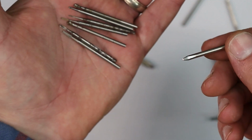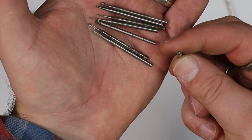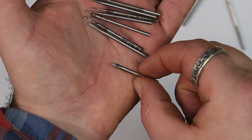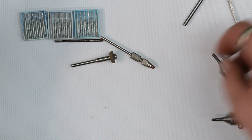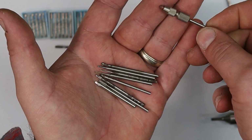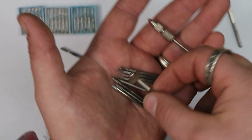And then I also have an old diamond burr that the tip finally wore out and broke, and I shaped that down to a little line shape. So we're going to try this on camera and show you what it looks like. I haven't tried it yet, so if I fail, you're all going to know it. Next we have polishing tools, polishing burrs. These are little fun pin polishers. This is a Cratex wheel. We're going to try using that to maybe polish some metal.